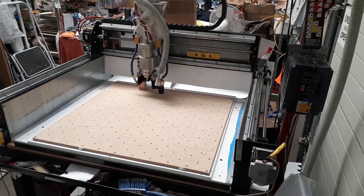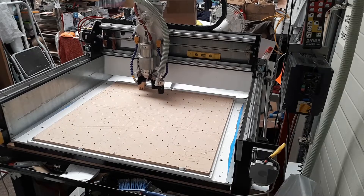It's a steel frame CNC with a 2.2 kilowatt water-cooled Chinese spindle and NEMA 34 stepper motors — plenty powerful for the size, possibly too powerful, but I'm not knocking it. It's good solid construction; I would have liked it a bit heavier in weight and may have to add some weights in future. It's only when cutting intricate stuff with the X and Y moving rapidly in short distances that it bounces around a bit, though it's never affected the quality of the cut.